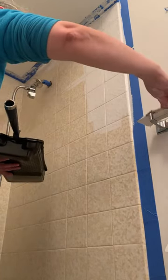It left some marks, so I'll wait two hours to put the second coat on and see how it dries. I had a hard time with the corners — the more I painted, the closer I got to the corners, and the edge of the roller made marks. I'll be more careful on the second coat. It's a very thin first coat. The bucket should be enough for two coats, maybe even a third.